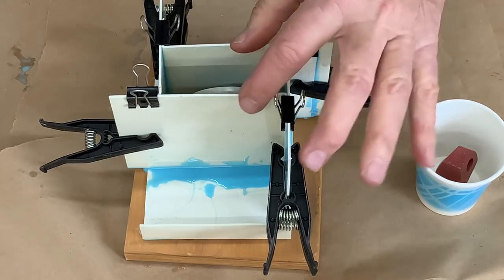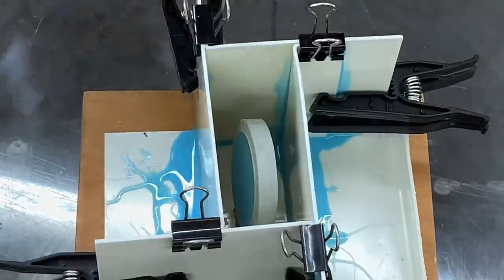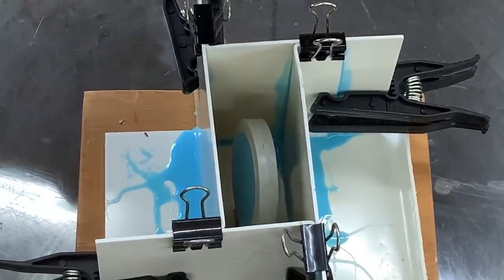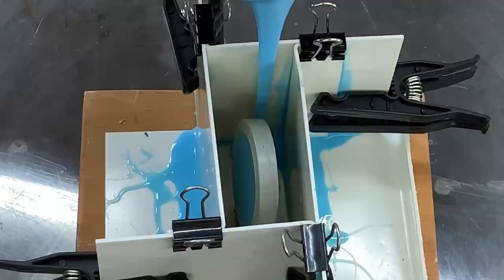This mold case is sealed and dried and hardened and beautiful — it's ready to pour. We're going to fill this mold quickly, pouring from the bottom up. I'm not going to worry as much about draping as I normally do, because we're going to first pour it, fill this mold up, and then vac it — post-vac the rubber. It's already been vac'd once, so the bulk of the air is out of it.